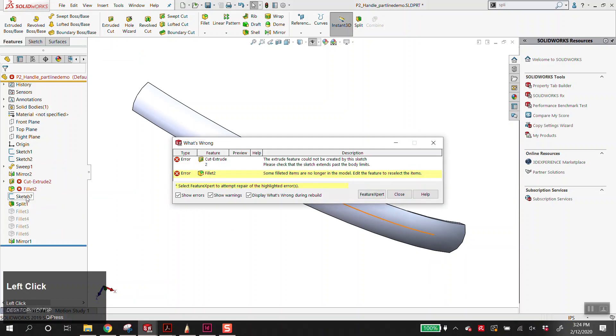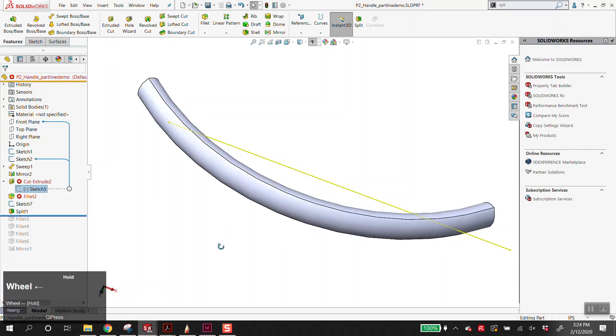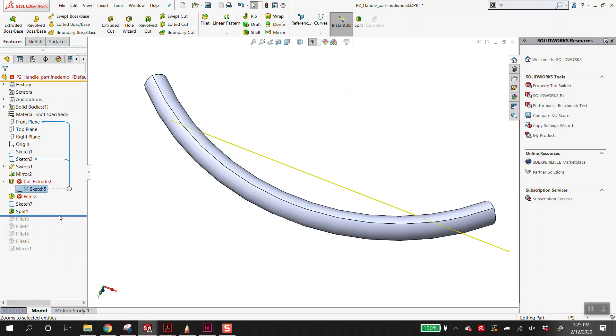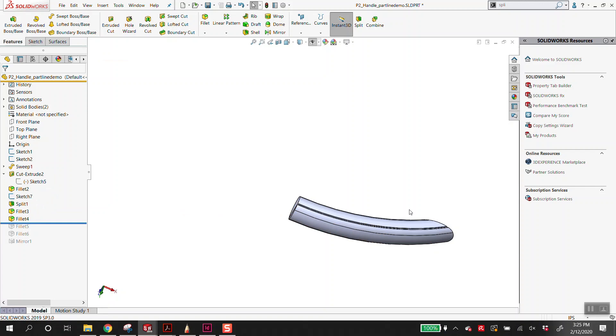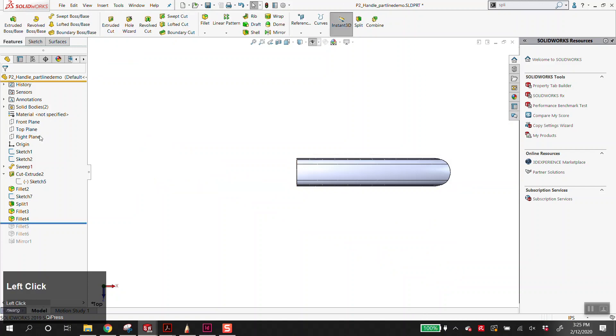What I said is I want to see three part lines across your projects. Ideally one should be on a handle. The remainder of this demo is just to create grips — which I kind of showed you with the knobs. Just to show you again: it's best practice to connect it to the origin. Create a circle, overlap it a little bit. Extrude cut — through all both — what this does is just makes sure it cuts the handle.